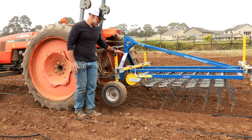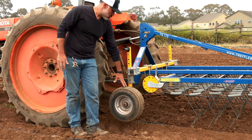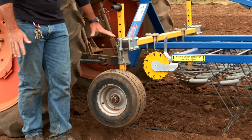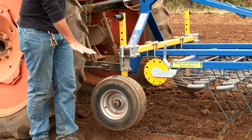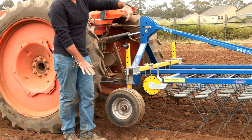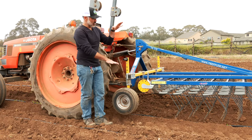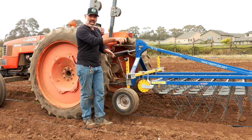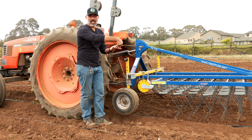The last part of these tine weeders is that they have a depth setting — these are gauge wheels. It's somewhat counterintuitive, but if you run the gauge wheels further down — so have the implement lifted up higher — it'll give your tines a more aggressive angle. When we don't want to run it that aggressively, we actually run it almost flatter to the ground so that the angle of the tines is more perpendicular to the bed rather than pointing in at an angle.